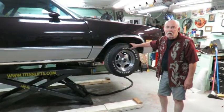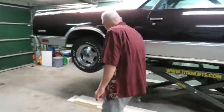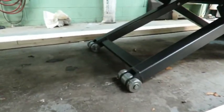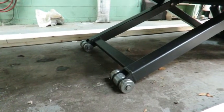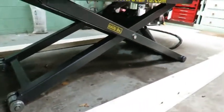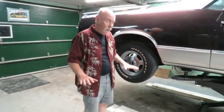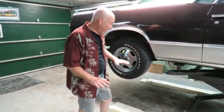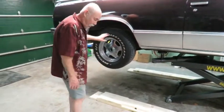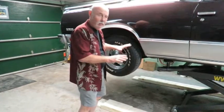Now I'm going to show you some of the reasons why I think this is the better hoist. For one, if you can see these legs here, it's one of the only hoists I could find that has three casters on each one of the main legs. I believe Titan put them on to distribute the weight and stop it from gouging the concrete — because you never know with older concrete if it's going to start to crumble. Better to be safe.